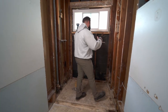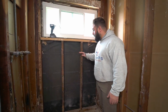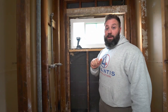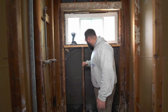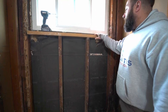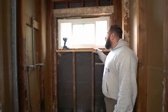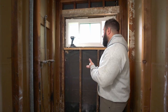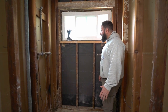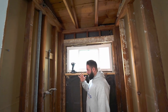First up, we're going to replace this exactly the way it was. I've already pre-cut the jack stud — or trimmer stud, depending on your location — and this top plate. We're going to disassemble this surgically without damaging anything else, especially the exterior part of the house and the brick, and then put everything right back.